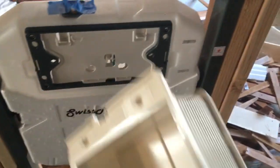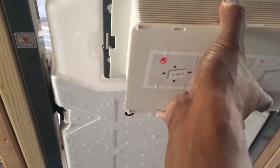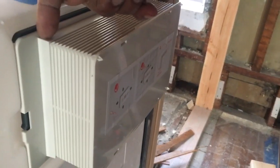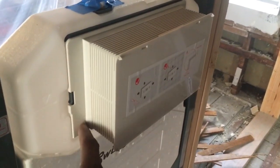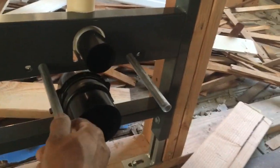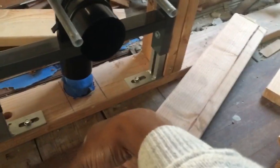And this part here just lets you rough everything in, lets you know how much depth you can cover. So this goes here. The minimum you can rough in would be right here. The max would be all the way out there. So I'm gonna put some backer board here. And I think I'm gonna do a towel bar here. I haven't really figured it out. And I may try to mount my toilet up here just to see how everything looks and how far the seat sits off of the actual floor, even though it's not finished yet.